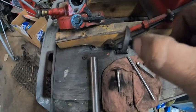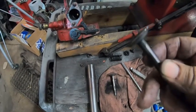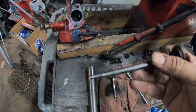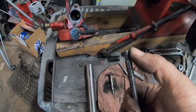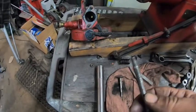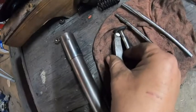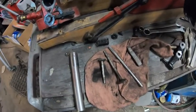One thing's important: you never want to have a sharp edge. If you have a sharp edge, heat tends to build up there and crack. So it's always important to put a radius in your joints. This is going to have a little bit more of a margin here, it'll be thicker so it won't be as thin. We also have some threads to worry about. Since this is going to be a little bit bigger, we'll have to bring this size down a little bit so we can put the original hardware back on — or I could just make new hardware. In this case I'm only going one size bigger, so I'll make it all work. This is just what I quickly ground up to get a quick profile so I can get a good radius in there.